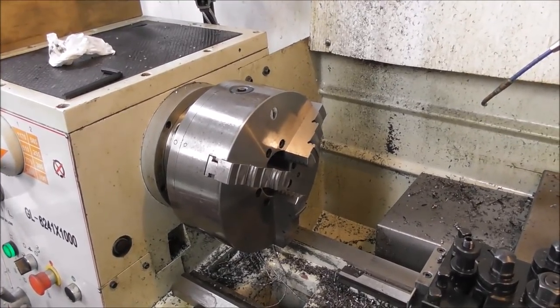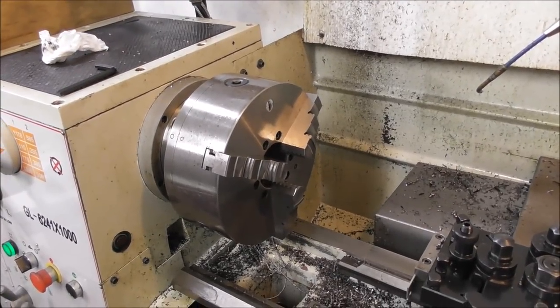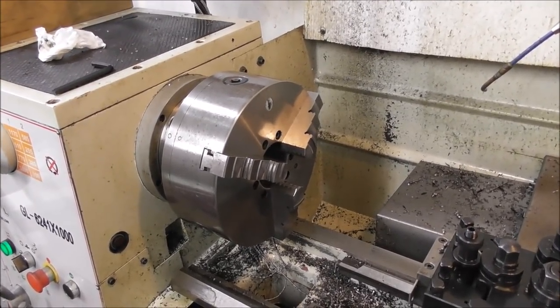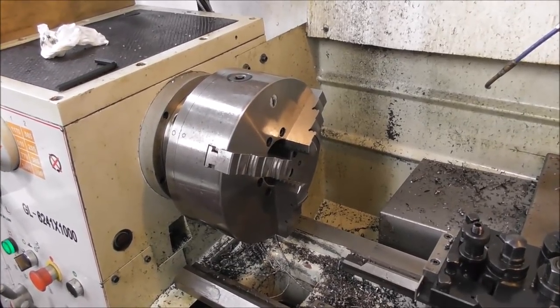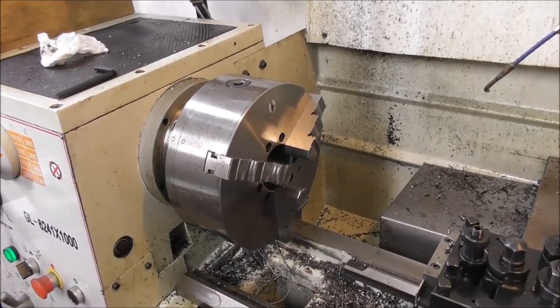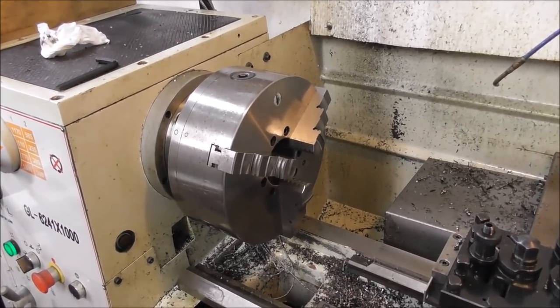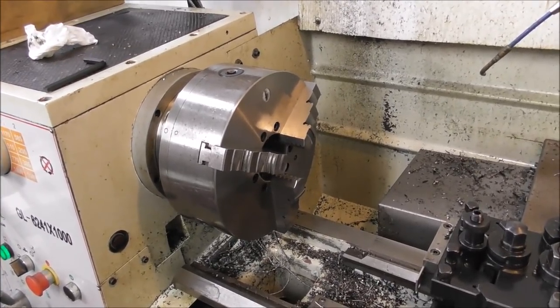And if you're using Slant Pro, I wouldn't run a chuck in the high speed range. Just stay in the low speed range, limited to 2,500 RPM. And just think through the implications of what you're doing. Just because I've never had a problem doesn't mean that I haven't come close to it without realizing at some stage in the past.